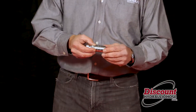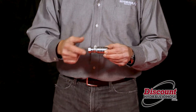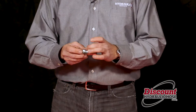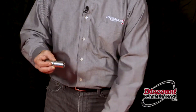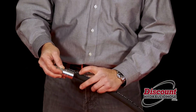As you look at your hose end, you're going to see that there are some dashes around the outside of the hose end. This serves two purposes: number one, it tells you where you want to crimp the hose when you're crimping the end on, but it also gives you a gauge of how far up the hose is going to go inside the hose assembly. We use that as a measuring point when putting the hose end on.